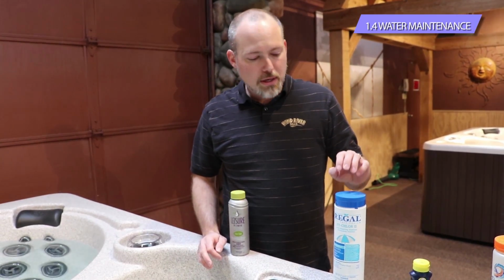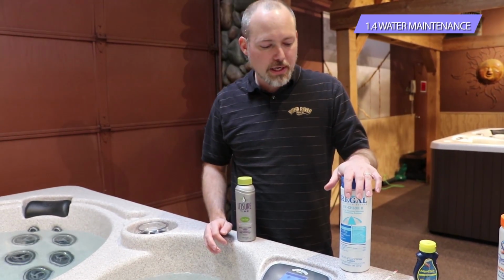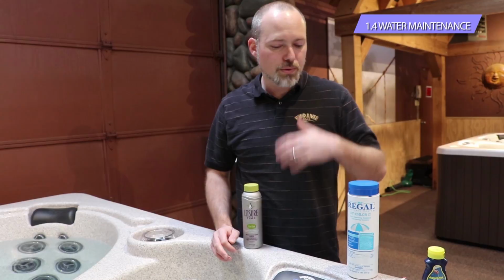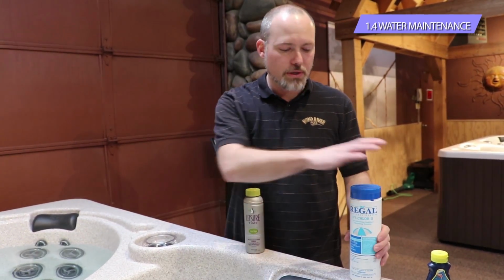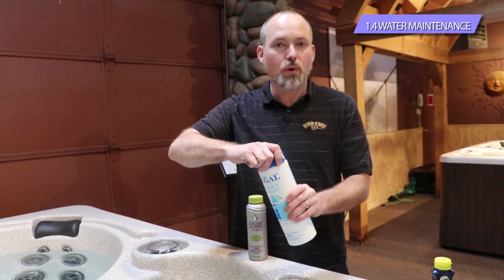If you're going to keep anything from this video, the most important thing that you need to know is the dichlor. We use a chlorinated concentrate for our secondary sanitizer to help kill bacteria, and really its only purpose is to clean up behind you. One of the most important things with a hot tub is as you're in that water, you have things coming off your body, the sweat, the bacteria, and so whenever you exit the tub, that's whenever the water is the dirtiest. So what we ask you to do is use a half a teaspoon per person whenever you get out of the tub of the dichlor, and you would do the same thing, throw it in and hit the stir button.